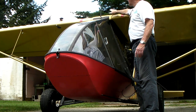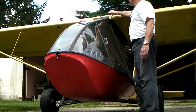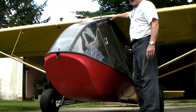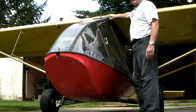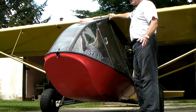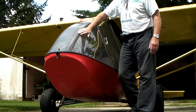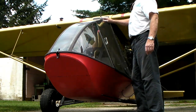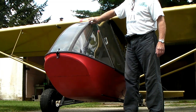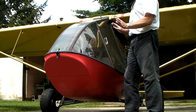It's going to necessitate taking off this center cover here and this piece which is stuck to it — this is a piece of sailcloth repair tape. You get that from marine stores or online. It comes in a big roll; that's what this stuff is along here. It's a Dacron material with adhesive on the back. You peel off a piece of paper and it's used to cover the heads of the rivets where the lexan is put on.